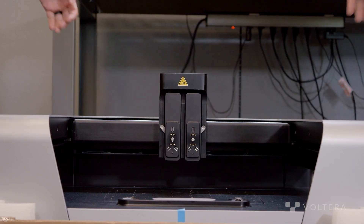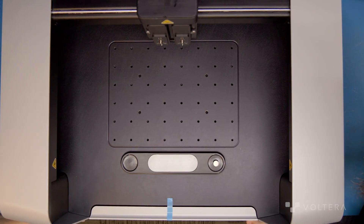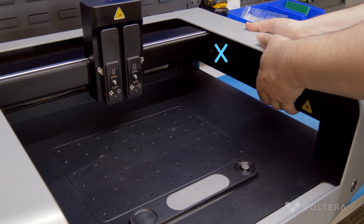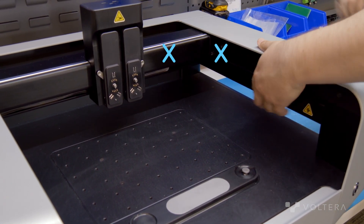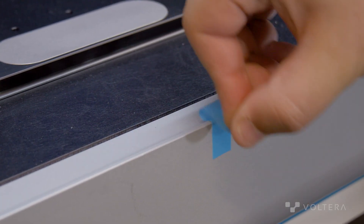Then from the center, grab the substrate folder, accessory box, and vacuum module. We'll go over all the accessories in a minute. With everything out of the top foam section we can lift it up and off Nova. This next step is where a partner is needed — together lift the Nova from the bottom and relocate it to the workbench. Nova weighs 77 pounds so please be mindful of proper lifting technique. It's also important to avoid lifting the machine by the bridge as this could affect the calibration of your unit.